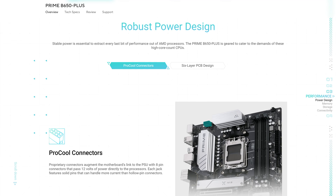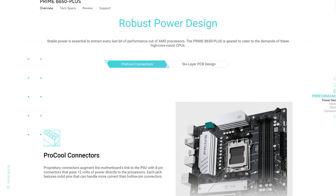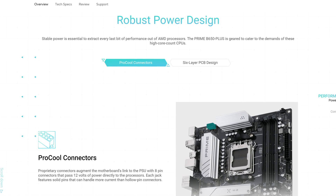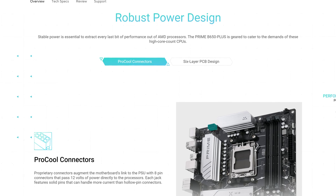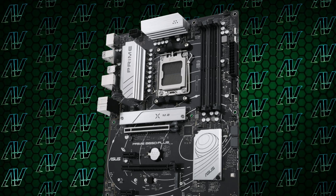And then there's the VRM situation, or rather the lack thereof, seeing how even on the website, Asus refused to actually tell you how many power phases this motherboard even has — almost like they're embarrassed of it — seeing how the motherboard appears to only have a 9+1 configuration. And while yes, that is a lot less than even other B650 motherboards, you've got to remember, this is $200, so you're going to have a hard time finding a cheaper B650 motherboard that is worth your time. Somewhere compromises have to be made.